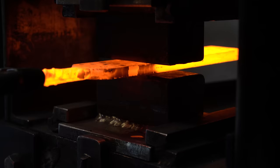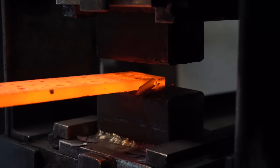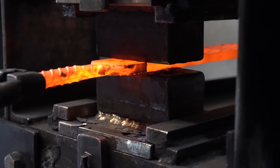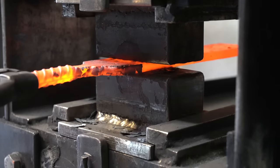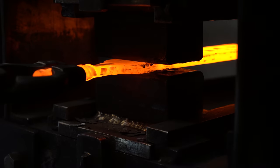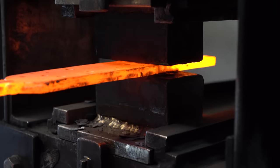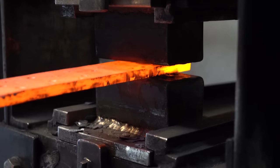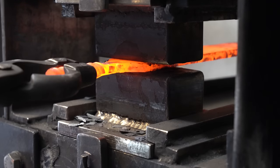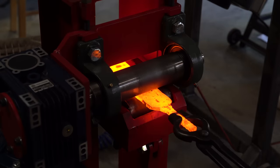If you don't have a press this may not be obvious, but presses are not really good at thin pieces of steel — they're much better at thicker pieces and squishing them down. That's why it's important to take small bites and have a narrow die so you don't have a lot of area to impact. Now we're going to draw out and reduce the thickness of this billet and try to get rid of all those dimples.